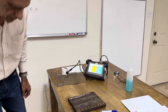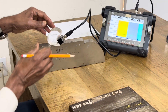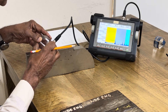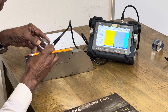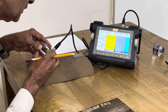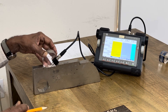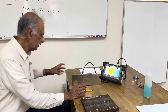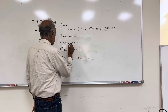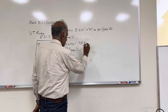The first step is to go to the IIW block and obtain a signal level of 70%, then read the gain on the screen. As you can see, the amplitude is 70% and the gain is 48.8 dB. That value goes here as number B, which is the reference level — 48.8 dB.